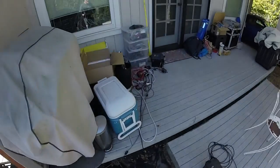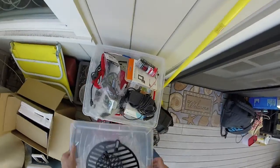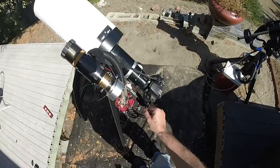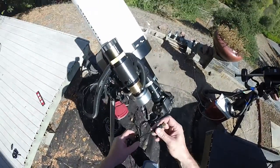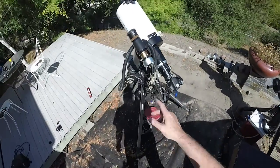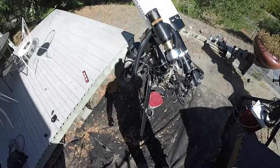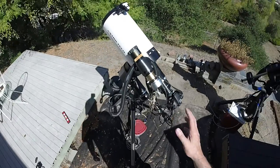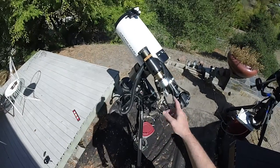I run this in and out of here a couple of times to make sure there's no corrosion. I also have, buried in one of these boxes, some contact cleaner that I use when things don't connect. So we've connected the camera data and power, and we can connect the auto-guiding camera. You'll notice I don't have an ST4 cable going from here to the mount, and that's because I'm doing what's called ASCOM pulse guiding — controlling the auto guiding through this USB data cable and the mount through its serial connection, versus a separate cable.